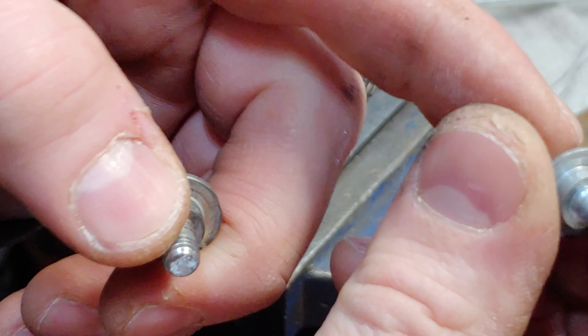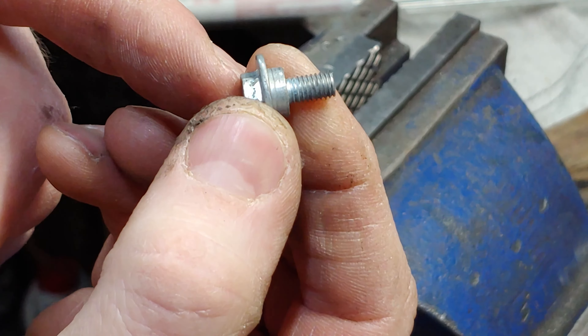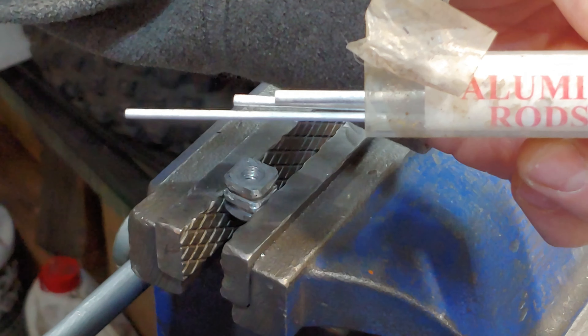So I got some of these aluminum welding rods. What happened was — the normal size bolt is supposed to go in there and it stripped out, so I ended up cramming one of these bigger ones in there for the time being. What I'm gonna do is use some of this welding rod material, stick it down in there first, fill the whole hole up, then drill the hole out, re-tap it, and hopefully we'll get some better threads. So I'm gonna clean this thing up and make sure there's no junk on it.